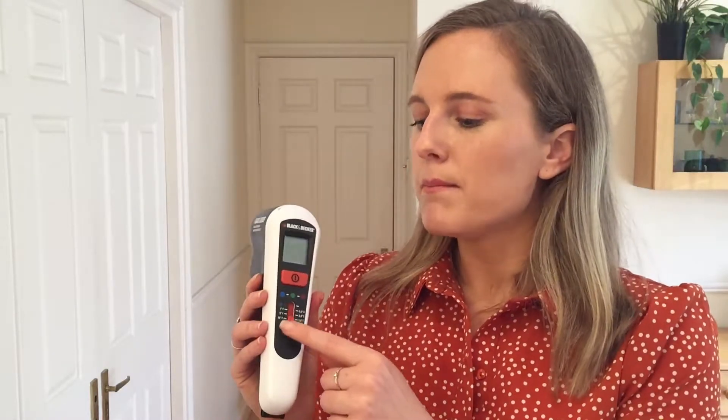To detect a change in temperature you can set a threshold on this tool by moving the dial. The threshold temperatures available are between 0.5 degrees Celsius to detect smaller changes in temperature and 5.5 degrees Celsius for more significant changes. As you move the thermal leak detector along the surface you'll notice the LED light will change from green to blue if the surface is colder than the reference temperature, which may mean you have a cold air draft, or it will change from green to red, which means the surface is warmer and heat may be escaping from your home.